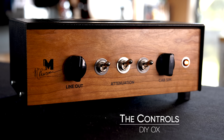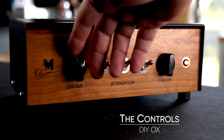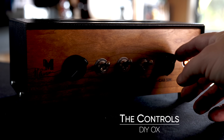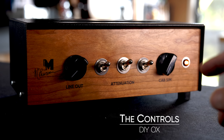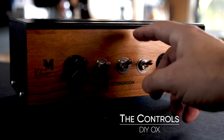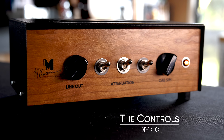I just want to go through really quickly how this works and how simple this actually is. Starting from this side, we've got a line out — that's for our balanced line output, and that also drives the cabinet-emulated line out as well. One really cool thing about this is that it's pretty much totally passive. The only thing you need power for is the cab simulator — the reactive load, the attenuator section, and the line out are all passive. The attenuation is very cool. At the moment it's always attenuating about 7 dB all the time, and then you've got attenuation switches: 3.5 dB, 7 dB, and minus 14 dB. You can combine them any way you want to create different levels of attenuation — there are actually more levels of attenuation than on the OX.